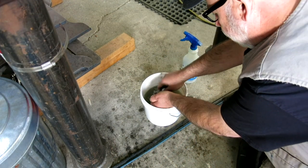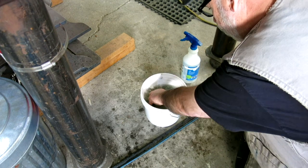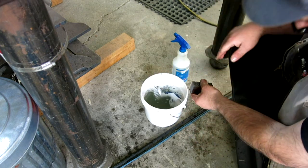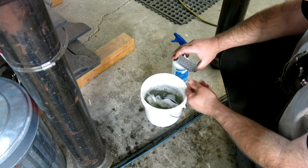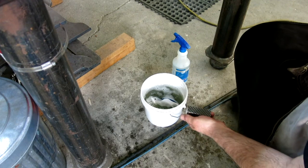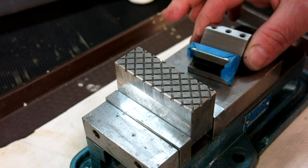You spend a fair amount of time just cleaning the lap out. This is water with a little Simple Green. What I do is keep the water out in the shop so it's really the same temperature as everything else — hot water works better, but you change the shape of the lap. If you're doing a big flat surface you can cause the lap to change shape. So we're looking pretty good — can you see yourself? The lap is dry right now but still charged with the aluminum oxide micro lap.